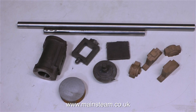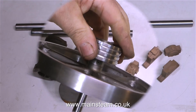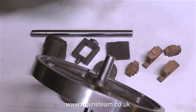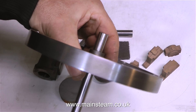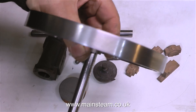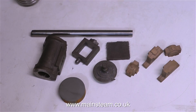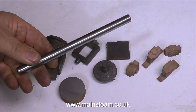At first sight, this may seem to be a very simple job. It's a piece of steel bar, and all I have to do is machine a bit off the end of it to fit the crank web onto. There's more to it than that. On the original Stuart drawing, it shows a crankshaft of 7/16ths of an inch in diameter, and you're supposed to turn that out of the piece of mild steel that comes with the kit of castings. But I'm modifying this part of the design — I'm going to make the crankshaft half an inch in diameter, which will make it slightly stronger. And where bearing surfaces are concerned, bigger is better.